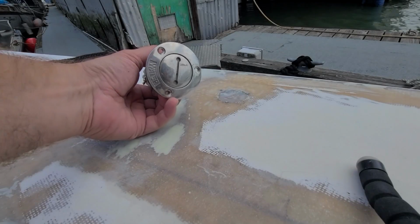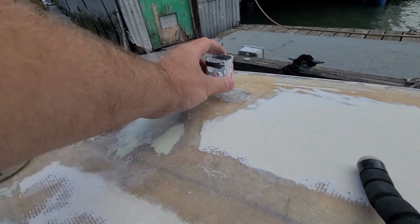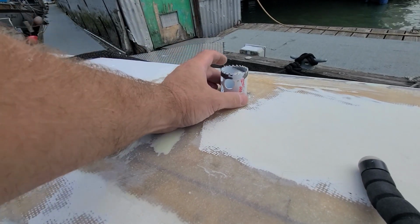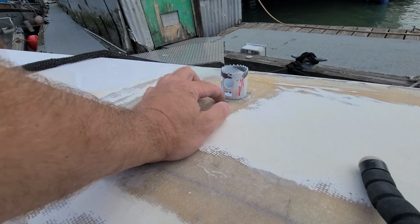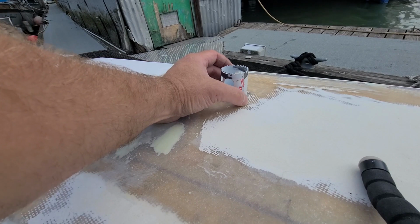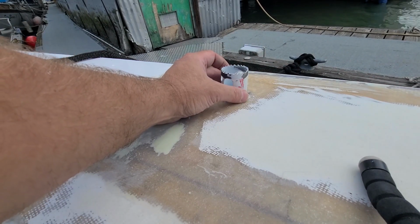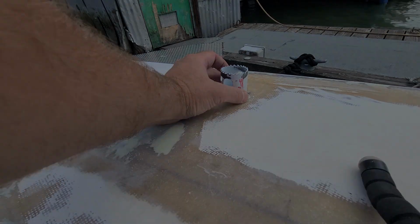It's time to drill a big hole for the water inlet, and I have a 45 millimeters hole to be made, and this is 44 millimeters also, but with the teeth will be 45 generally. Oh, I can just grind off the extras.